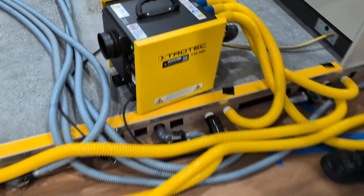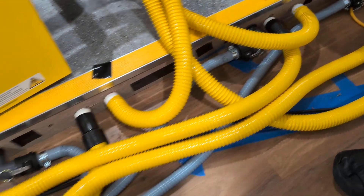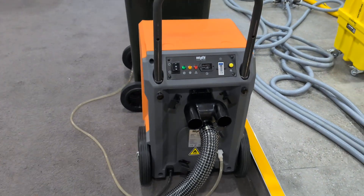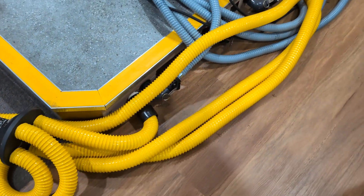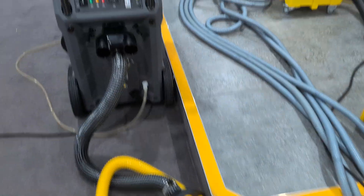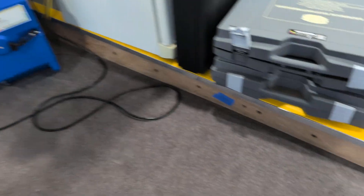What we've also done over here is we've got our desiccant running under the floor - three ports of desiccant going under the floor. We've also got our Halo KT45 with three ports going into another junction box here from Trotec, and now we've got four extra points. On the other side we have holes and we can feel the air coming through those holes.